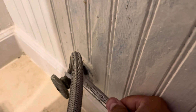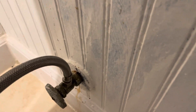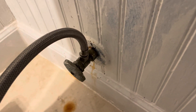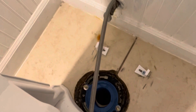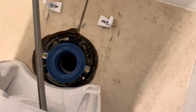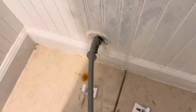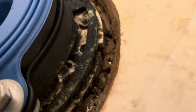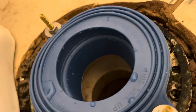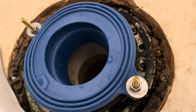The annoying thing about this is getting it lined up. If I turn this on then the toilet's gonna fill, so I might shut off all the water just to get it into place and then fill it. I was hopeful that this was just gonna line up and work, but not so lucky. I'm gonna add the spacer in and see if that helps because it just went out. Custom - because you gotta have a nice toilet. I added a half inch spacer, which is compactable, so we're gonna see when I put this down if it goes down far enough. Otherwise we can modify or use that other one.